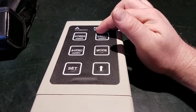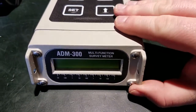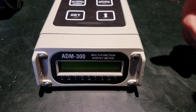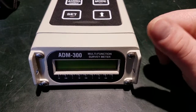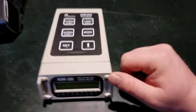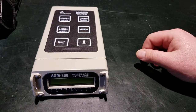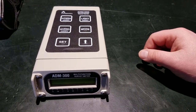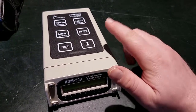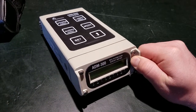So I'll cover the basics. It's a very simple six-key control panel: power, light, audio, mode, set, and increment keys. The menu structure is very simple — you've got dose rate and accumulated dose, and you can set both the dose rate and dose alarms. There's also a survey mode which kind of works like a scaler where you can take a long-term survey of a bunch of stuff and record the data as an average. That can be viewed on the unit or via the serial port on the accessory port on the back, which I'll tell you about in a bit.